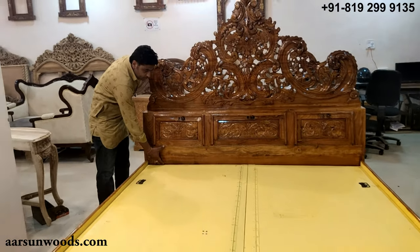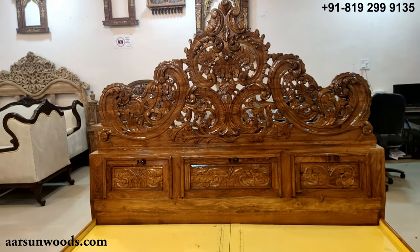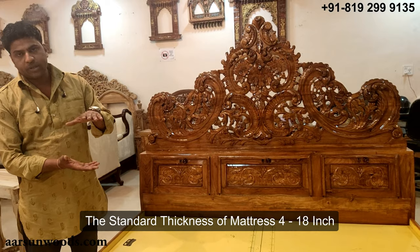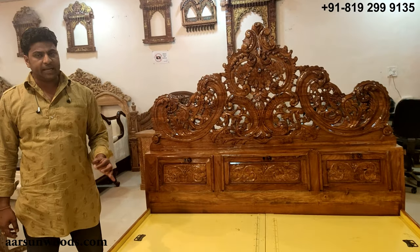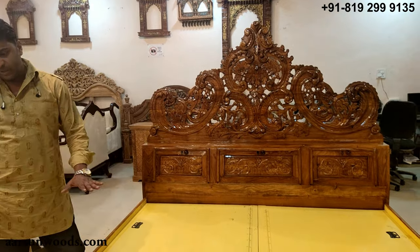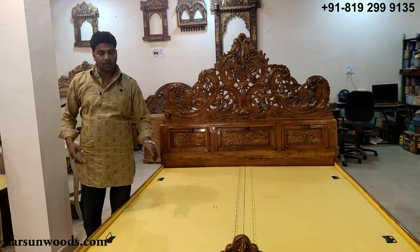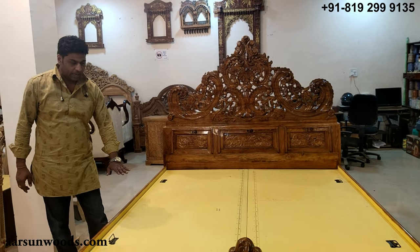The area here is for the mattress. Mattress thickness ranges from 4 inches to 18 inches. However, if you are using anything more than 8 inches, the storage area doesn't make much sense because it would be too small to store anything. We cannot increase the sitting height beyond a comfortable level — the standard is around 20 to 22 inches including the mattress.